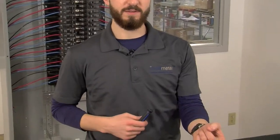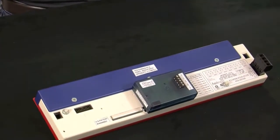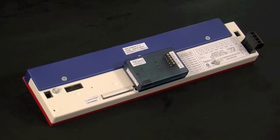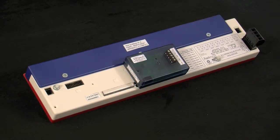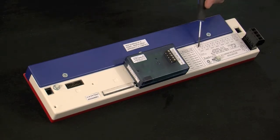Before we move forward, let's take a minute to go over some of the properties of the i636 meter itself. The i636 is capable of single phase, two phase, and three phase metering, with up to 16 metering points if all single phase, eight metering points if all two phase, and five metering points if all three phase. Our voltage input is auto-ranging and can be used on 120 to 347 volts, line to neutral. The i636 will come with a preset configuration, which will be predetermined based on your metering needs, and it must be installed in accordance with this configuration in order to function properly.